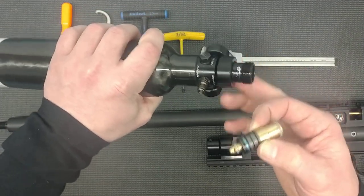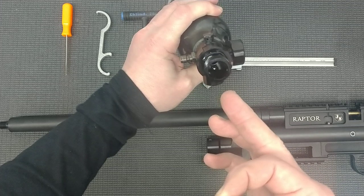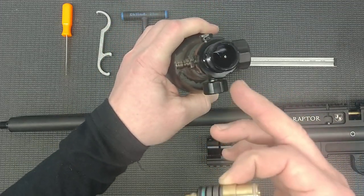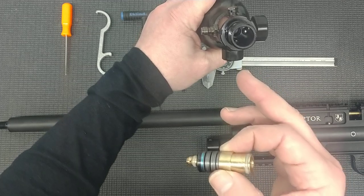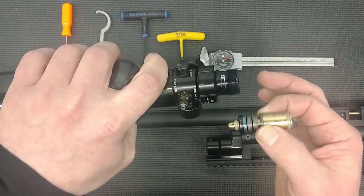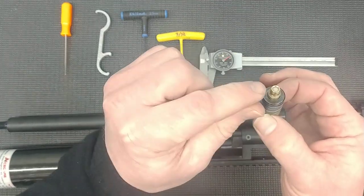This one is still clean, but otherwise I would clean it out very well. If the bore is super scratched up and ovalled, it might be time to get a ball hone to hone it out nicely so the carriage can travel freely again.